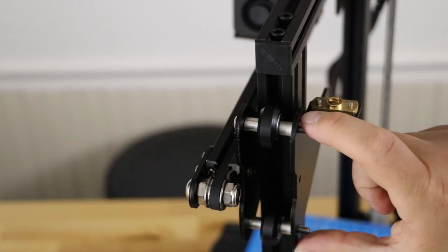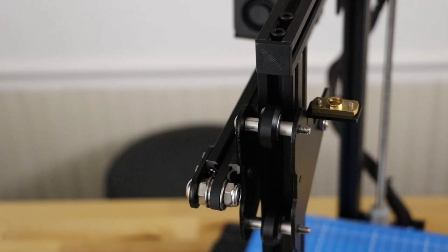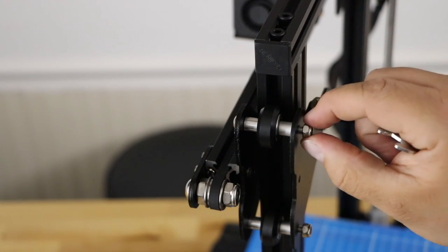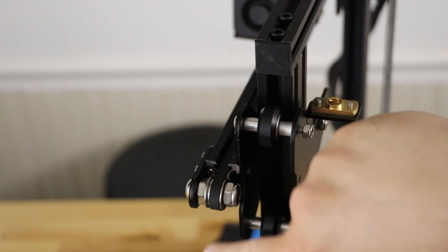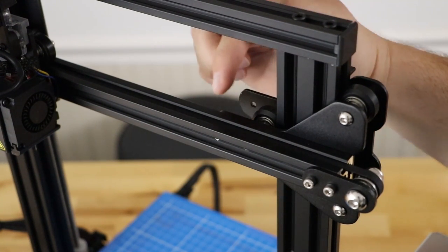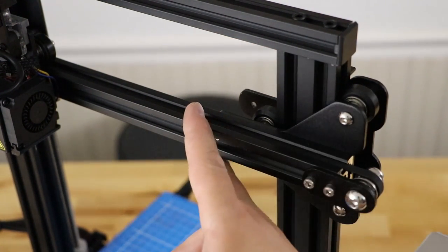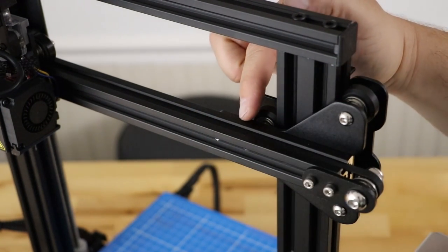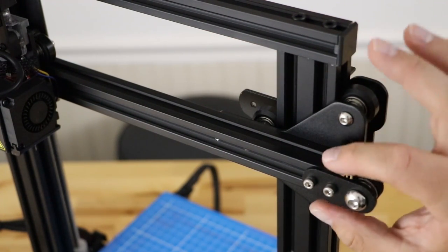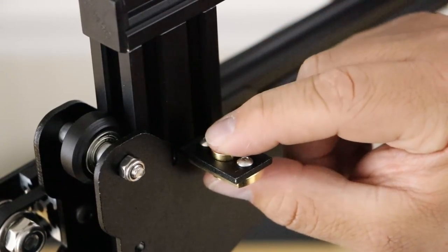Line that bolt up, push the bracket up slowly, and push your bolts through. Use your wrench and allen wrench to tighten the lock washers — but do not over-tighten; these wheels still need to move and slide up and down. Check that the bracket and the x-gantry are flush and level. If they're not, your x-gantry could be crooked. Loosen the two bolts, make it flush and level, then tighten them back. Next, adjust these two screws on the dual Z bracket just enough so the Z-rod can slide through freely.